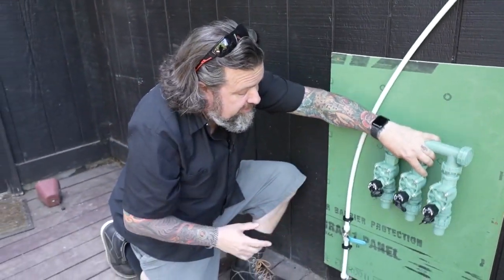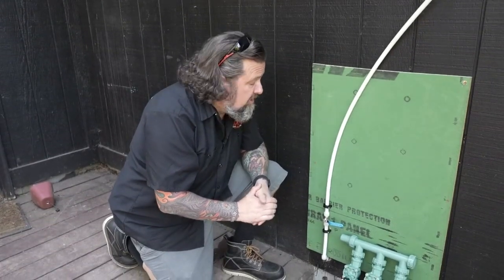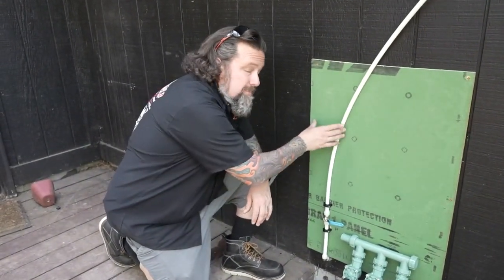This manifold is going to mount up here. Traditionally in a sprinkler system like this, especially in Oregon, you have to have a double check valve that must be certified every year. Mine is on the inside, so we don't have to worry about that here, but make sure you follow your local building codes so this doesn't put bad water back into your drinking water.